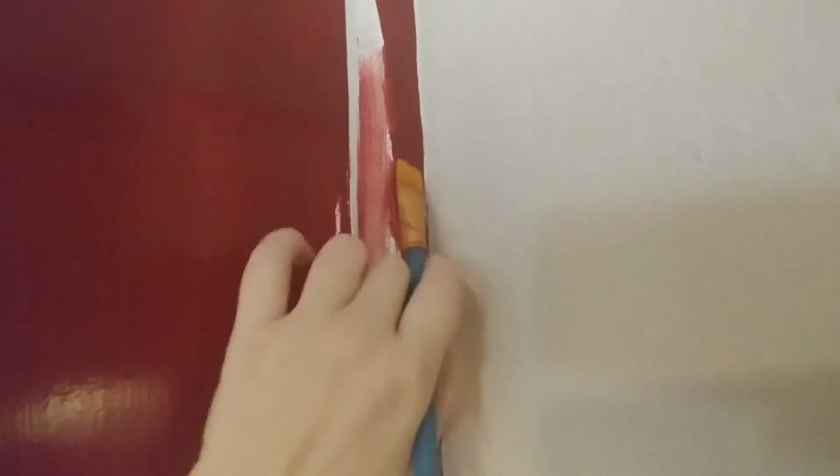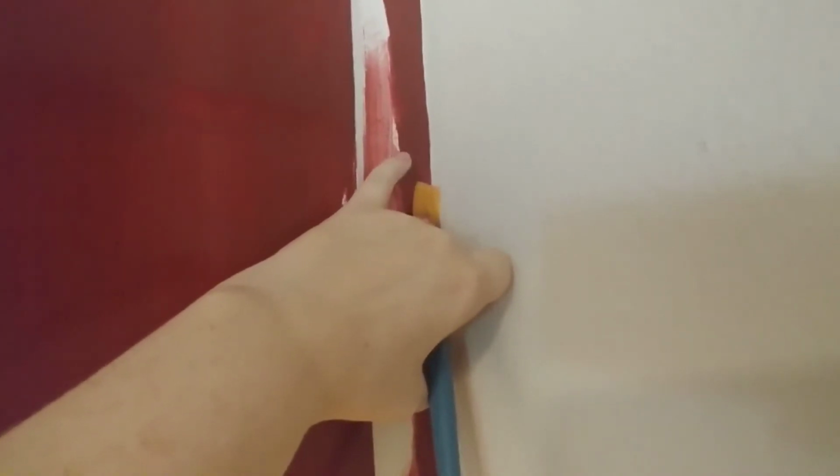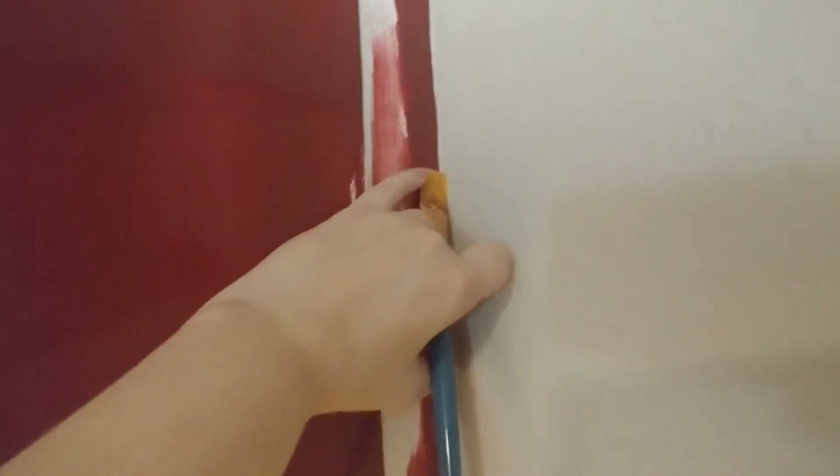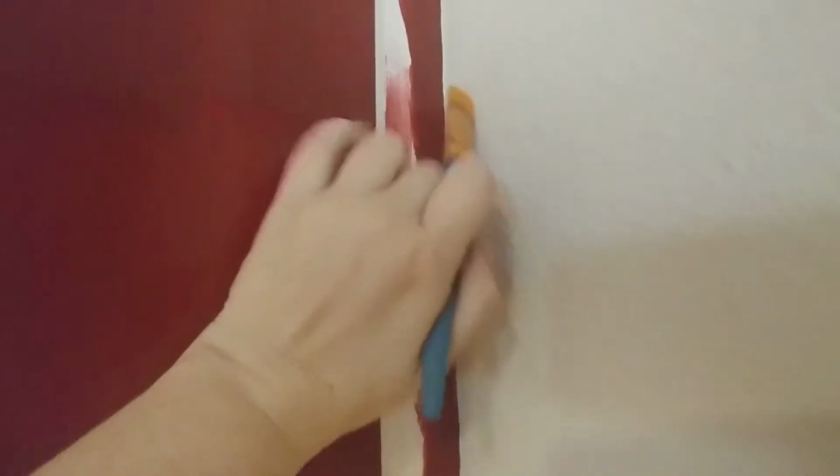Another thing I wanted to talk to you guys about is on the cabinets where it meets the wall or the ceiling. I painted down with the paintbrush like this, and then it caused a line, almost like a speed bump of paint. It was pretty thick and pretty high and pretty drastic. And so all down that left side, it caused that line.